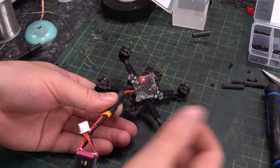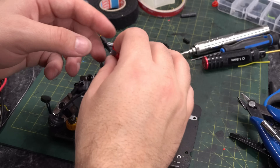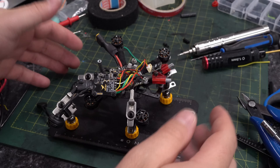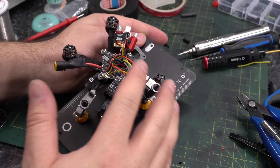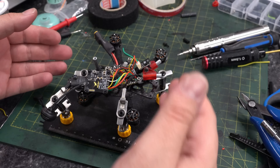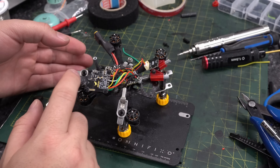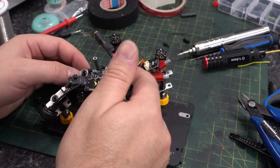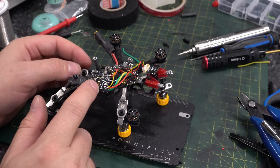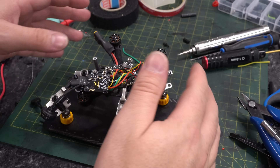That beeping is it not connecting to the receiver, so we're going to go ahead and solder on a receiver and a VTX now and add the rest of the components. It looks a bit of a mess right now, but these OmniFixos are amazing for this kind of stuff. When it comes to attaching stuff to most flight controllers, you need a power, a ground, a TX, and an RX. When you connect TX and RX, you cross them — TX to RX, RX to TX. We have our receiver wired up to TX/RX1, our VTX wired up to RX2, and our camera attached to the AIO. It gets power from the AIO, and feeds the signal back to the VTX to be transmitted back so we get that wonderful OSD display. Now I'm going to button everything up and move on to Betaflight.